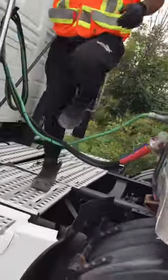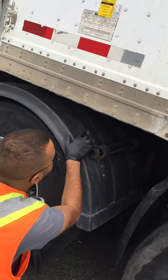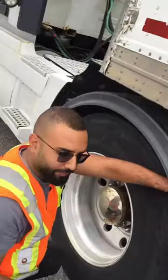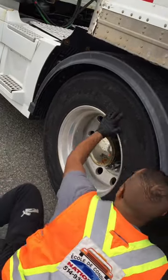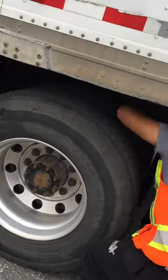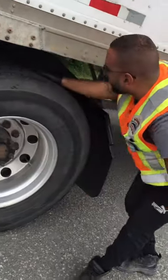You go back down. Start with the fifth wheel plate: upper plate, lower plate okay. Fifth wheel plate okay. Pin indicator okay. Lock pin indicator okay. Valve okay. Pin handle okay. Sliding plate okay. Anchorage and anchorage bolts are all okay. You do tires — first set of dual tires: inner wall okay, outer wall okay, nothing in between, inner wall okay, outer wall okay, rim, bolts, hubs, valves okay on each tire. Second set of dual tires: inner wall okay, outer wall okay, nothing in between, inner wall okay, outer wall okay, rim, bolts, hubs, valves okay on each tire.